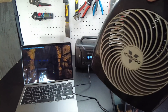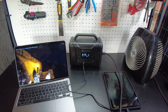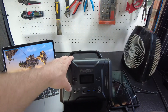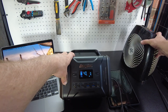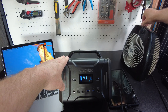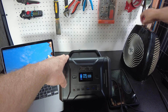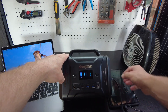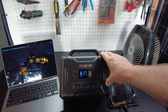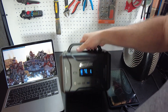Let's push it with this heater — I think the lowest setting is 700 watts. Worst case scenario it blows up. It went to 360 watts and then we got an error code. So the overload protection caught it — that's good, it didn't blow up. That's basically what we want to confirm — that the protection circuit works. Good sign.